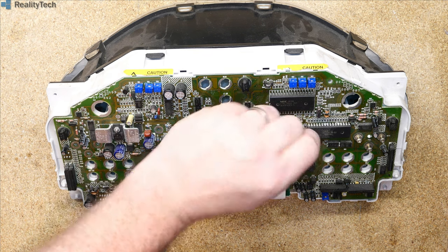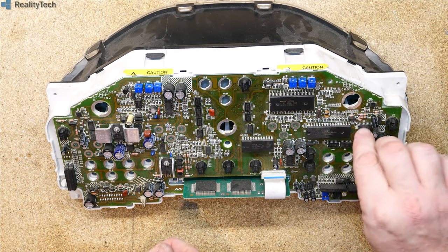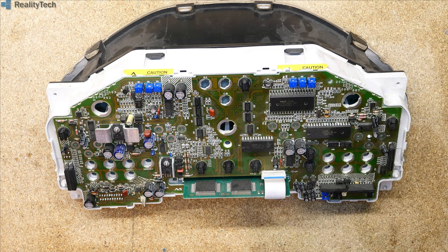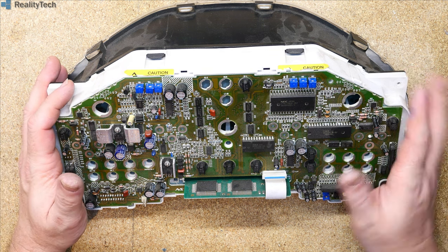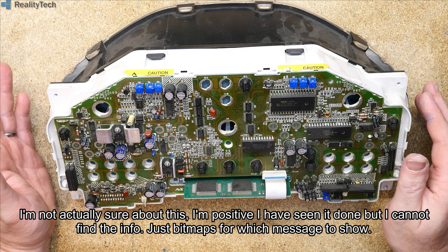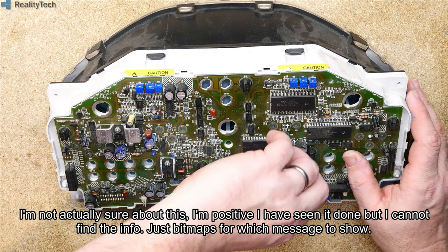So it is possible, and there is information which I'll post a link to down in the description, it is possible to actually address and talk to this without the BECM and send messages to it. All of the dashboard messages are actually pre-programmed in the ROM, so there doesn't appear to be the ability to send free coded messages. It would be nice. Certainly it's something that's been thought about.